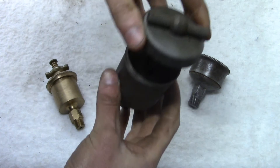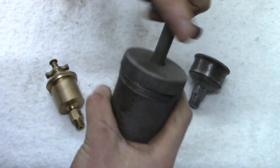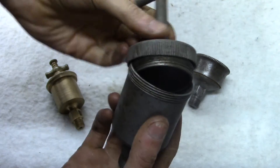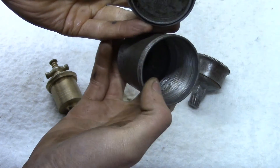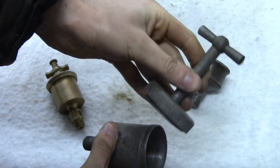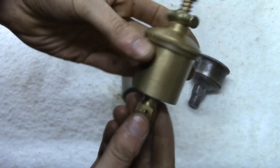Here's another slightly different style of grease cup — same basic concept, except this lid is just a lid; it doesn't force the grease in. The inside of the cup is also threaded and you can take this plunger out. It's the same concept except there are threads on the ID rather than the OD of the cup, and the grease gets packed in here rather than up here.